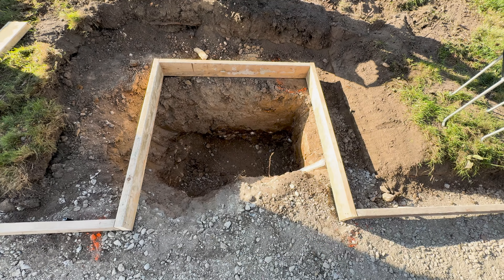That is the back patio. You can also see these four grade pins that we set — we'll check those the morning of the pour. They help the guys working the concrete to make sure we get the proper grade, that there are no puddles, and that all the water flows the right way. One thing we didn't think about is space: the bull floats and the long poles they use to smooth the concrete need room to operate. We actually had to move the swing set back to the tree line to give the concrete guys enough room to get their job done.